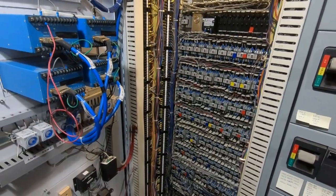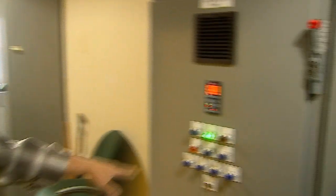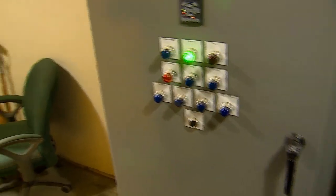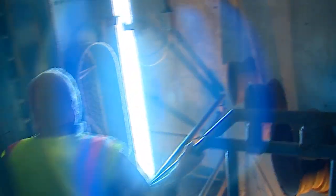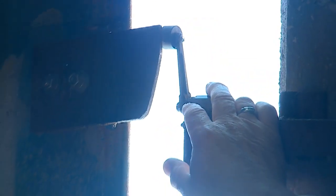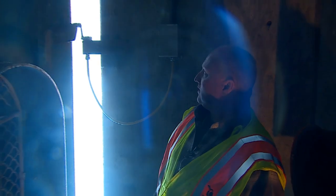These are all of our control breakers — these are all brand new, these are the brand new drive systems here, for the two on this side of the bridge. There are two more just like it on the other side. This is a fully closed limit switch. On the control panel upstairs you see the light — the white light means it's fully seated. That's the switch; there's one on each leaf, on all four sides, and they've all been replaced, they're all new.